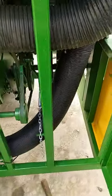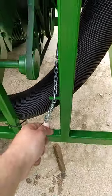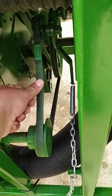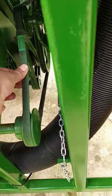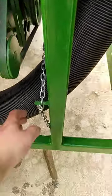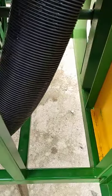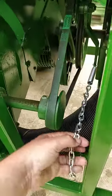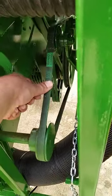There are chains like this in your machine used to stretch the belts. To check if a belt is tensioned correctly, push it slightly — just one finger pressure is enough. If it's too loose, you'll see it give. To stretch it, pull it and put it in place, then check if it's okay.